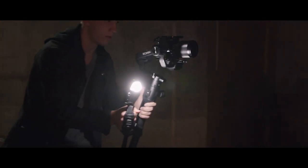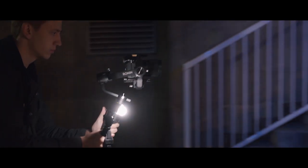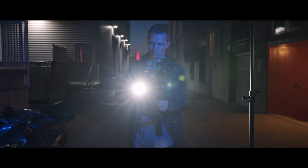Another great feature about the Lytra torch when it comes to light output is that it's flicker-free when on camera. The light is obviously being recorded right now, but it's not flickering like you can see sometimes when pointing it at certain LED lights. Because the frequencies aren't matching up, you can see that flicker in post-production. But you don't have to worry about that with this light, especially when filming in slow motion or full HD.